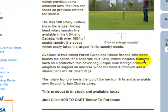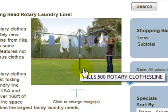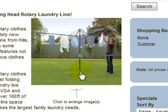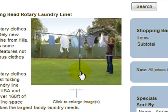Just to explain a bit further about the ground sockets: the pole of the clothesline doesn't cement directly into the ground. There's a ground socket or sleeve that you cement into the ground, and the pole of the clothesline simply slots into that socket. This allows the clothesline to be removable if you want to use your backyard for a party or function — you simply fold up the arms vertically and then twist and pull out the clothesline.